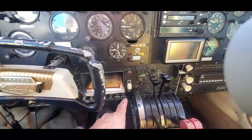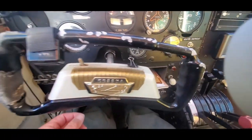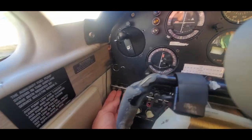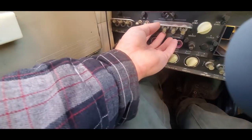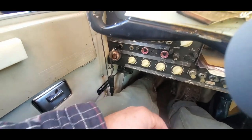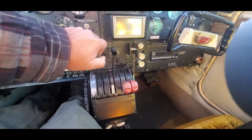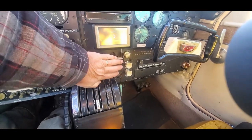Let me show you the Cessna 310 quick start procedure for Harvey, the 1959 C model 310. First, make sure the gear is down, the flaps are up, and the fuel valves are where you want them before you start firing things up. Get the battery and generator switches on. Get all four magneto switches on. There is no key on the Cessna 310. Now we'll move all our control levers full forward: throttle, props, and mixture.